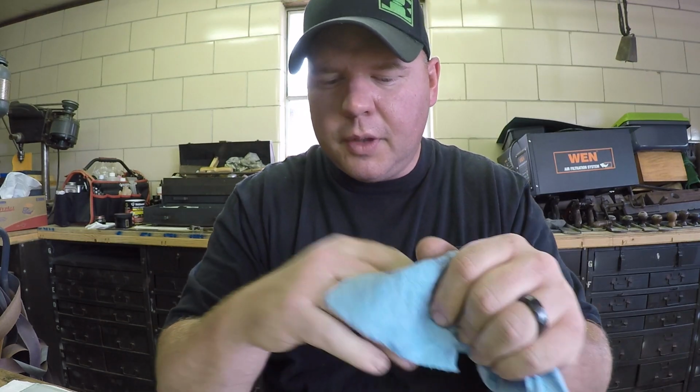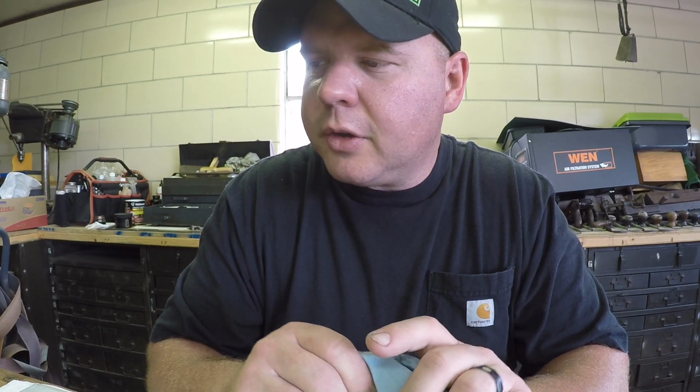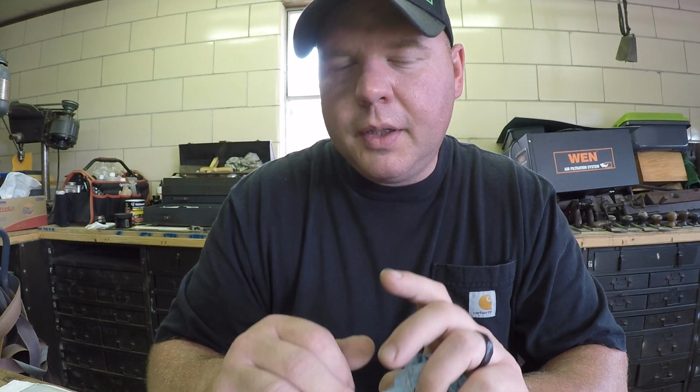You know, even in my shop, when I'm first sharpening an axe, I will actually use a file to set my profile, but then I'll use my Lansky Puck to establish that initial edge and take out the scratches from the file, and I'll work it up to the finer grit with the Lansky Puck and get my burr on the edge working back and forth. If it's a utility axe, I'm done at that point. I'll hit it on a strop real quick and then it's ready to use.